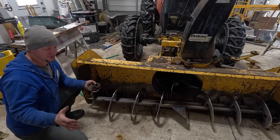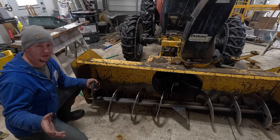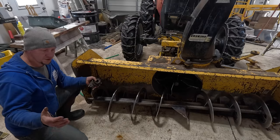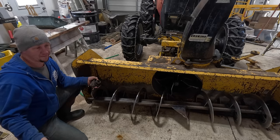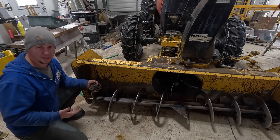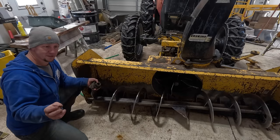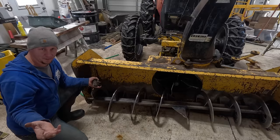This one stretch of road that is always problematic for me is full of large cobble stuff all along the edge of it. And the problem is that the road shape through there is more or less a trough, so there's no shoulder for it to just fall off. The thought being, like, the first time or two we clear snow, we can clear it with blades and push everything to the edges and everything's clear and good. But what actually happens when you're running a blade along is it's real easy to hook just a small portion of the rock and flip a big rock into place that would have been out of play to begin with.